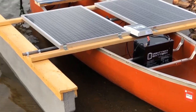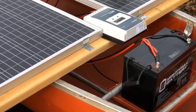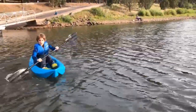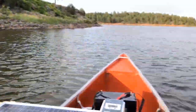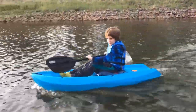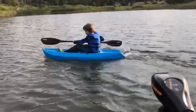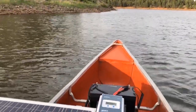There are other considerations too. Generally speaking, you don't want to fully discharge these batteries. These deep cycle batteries are not really designed to be fully discharged and then charged again — bad things can happen. So I would recommend taking your time and learning a little bit about the different types of batteries. I chose to go with the heavier weight but cheaper and well-proven type. They function a lot like a car battery, but with internal components that allow them to be discharged into that 25% to 50% discharge range fairly regularly, then receive a charge, without ruining anything in the process.